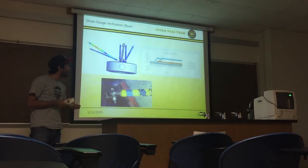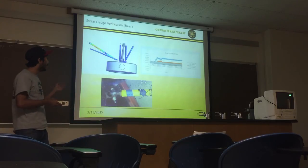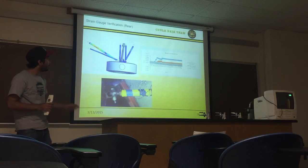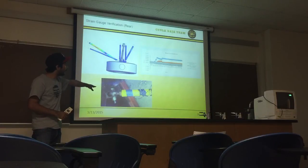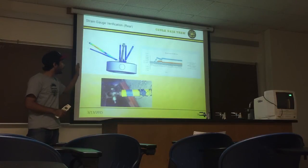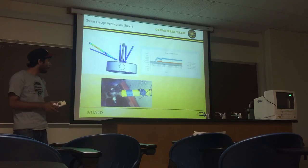So now the rear. The rear was quite difficult because in SolidWorks, it actually thinks everything is perfect. So all the angles, everything, all the mates I created, they actually go up and down. But in real life, the bottom trailing arm is at an angle, so it was kind of forced in and bolted on. From those results, we could see that this little angle could create that small amount of strain that we see, which we shouldn't see any strain. We should only see tension and compression forces on the rear links because it's a two-force member.